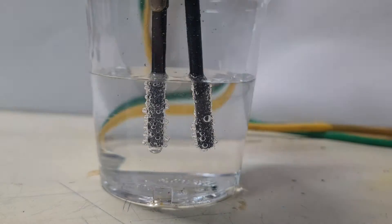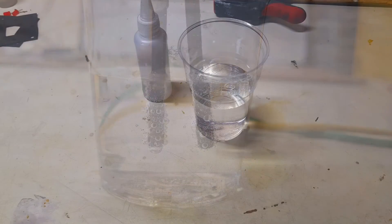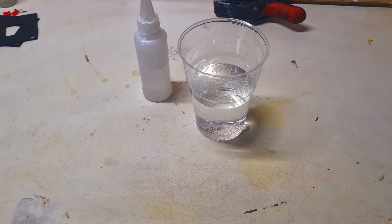And again this kind of device will also not be so interesting because you will create some chlorine gas and also the efficiency is not so good. But what will happen if I separate that cell — separating the electrolyte to get some anolyte and catholyte? Then in this case I will get a little bit more interesting device, which also has a lot of attention among many researchers.